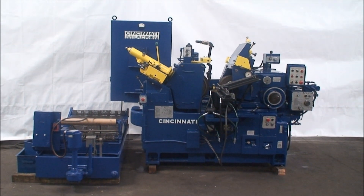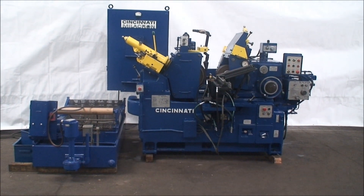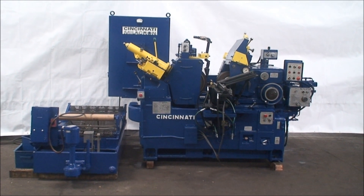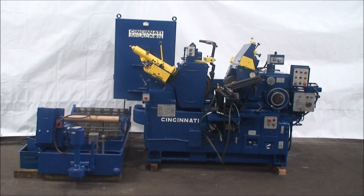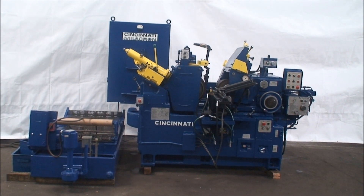It has hydraulic profile regulating and grinding wheel dressers. It's equipped with a spindle reciprocator attachment, grinding wheel autobalancer, and dovetail upper and ball lower infeed slides.